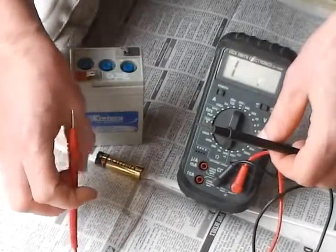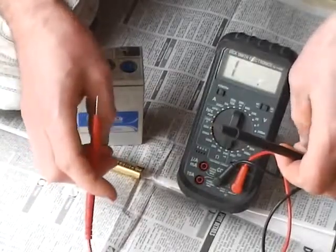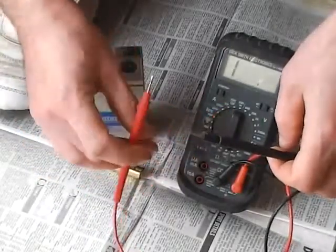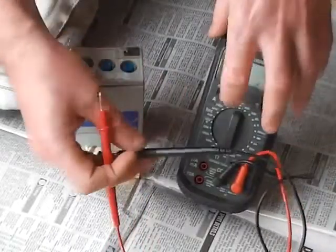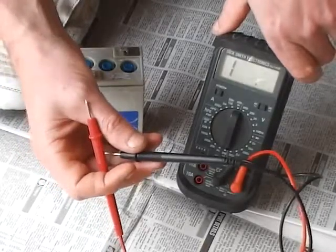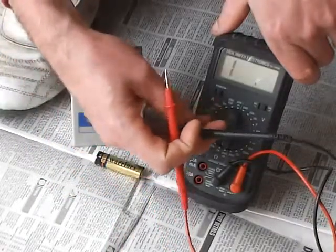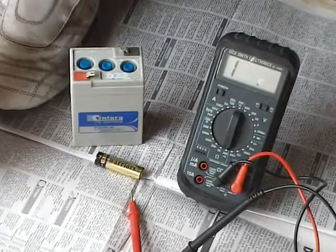If you have real issues with solar panels playing up — I had one that must have somehow gone into a series or something, something went wrong, and it was showing double voltage. And the only way I found out was with this machine. So these are invaluable to have, especially even if you just use it for polarity testing and checking your positive and negative are right, and continuity testing. They're invaluable to have. And at five bucks, you'd be stupid not to get one.